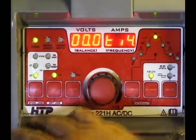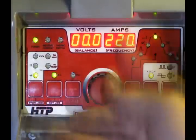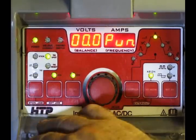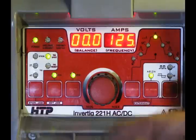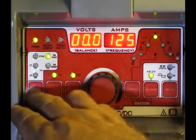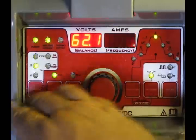The machine has several different modes selected via the mode button. There's standard TIG, and 4T mode — that's very popular in Europe and uses a torch with an on-off switch. There's also TIG spot, which lets you set a spot welding time: hit the pedal, it lights the torch for a specific amount of time, then shuts itself off — great for repetitive work where consistency matters. You can also switch it over to running stick welding, which adds versatility. But for most purposes, we're buying this machine as a TIG welder and will leave it on 2T, which is the standard mode.